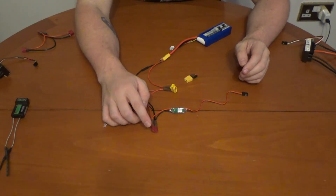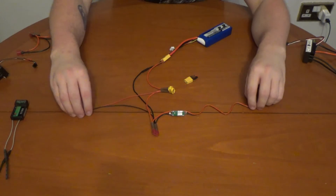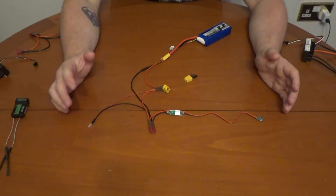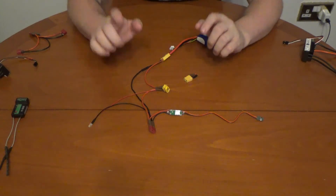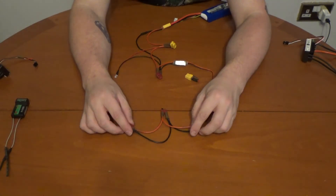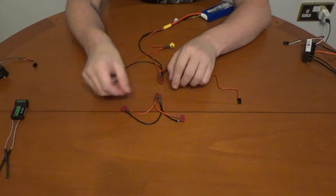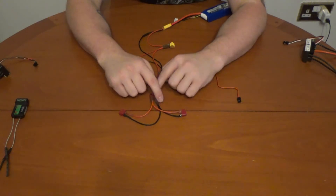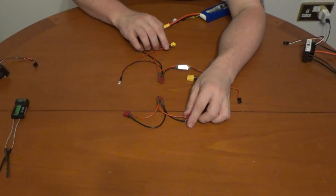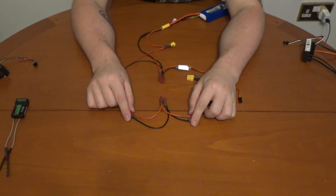On this Dean plug, two red wires go onto this section, three black onto here. Now we have this connected up, it's time for the next piece — which I call the electric junction. What happens here is this Dean plug connects into the bottom of here. You have two red wires coming out and two black coming out as well. The power coming from here, all the way through the circuit, lighting up the LED, going through the BEC to here, then splits — and this is where your speed controller will fit.